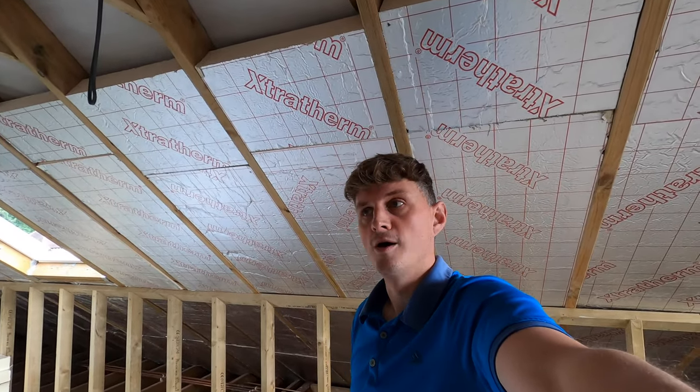So to show you the 100mm insulation, obviously I've showed you previously in this video and you've seen the time lapse of me working, but that's the 100mm in between. I ran it all the way down there, even though building regulations actually state I don't have to, but I thought it's best if you're going to do a job to do it properly.